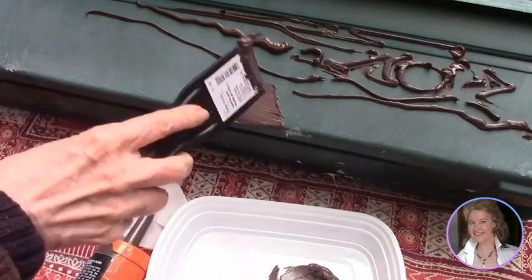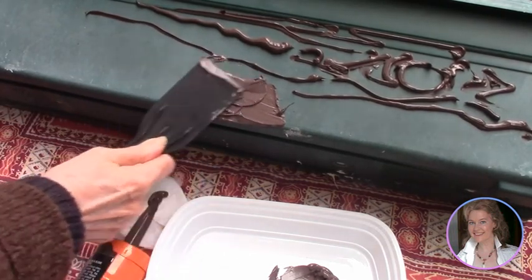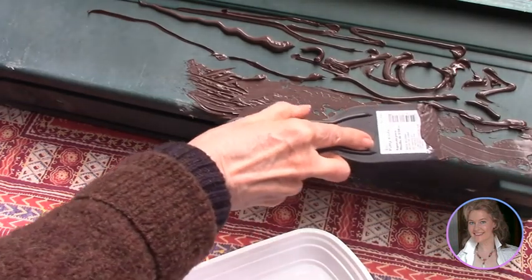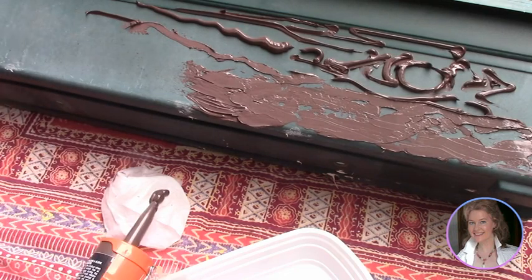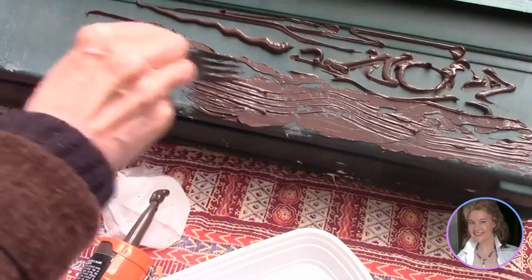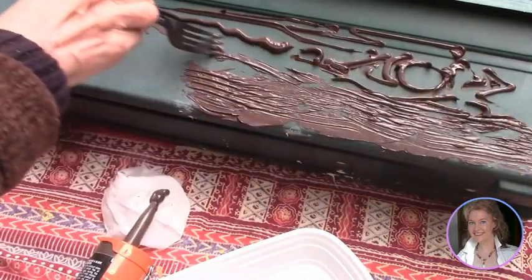We are spreading the caulk with a putty knife. We'll want to try and cover every part of the flower box that will show. We did texture most heavily on the front and the top rims and just inside the opening because that's what you're going to see on our boxes. But we put very little caulk on the sides and the back and none at all on the bottom. For our purposes, it took 2 tubes of caulk to do these 3 boxes.